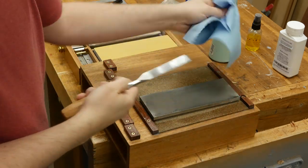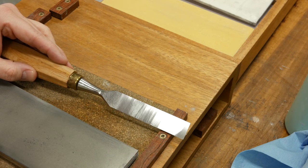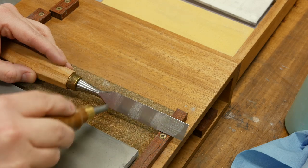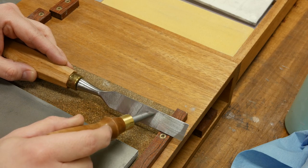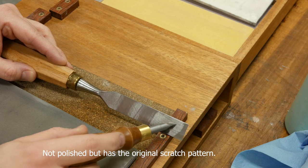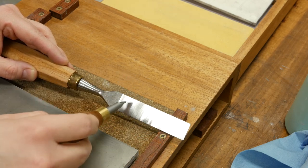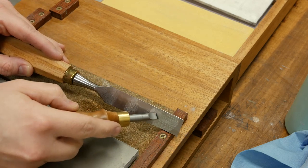Do about 10 passes, then slide the chisel up closer to the edge — not on the edge, but probably about a quarter of an inch away — and do a few more passes, just keep working it back and forth. Now stopping to take a look: you're going to see two different scratch patterns. The ones from the factory go one way, the ones I put on go the other way. As you can see, it flattened it here and up at the tip, but right here it's still polished — so it's not exactly flat. I'll have to keep working it until I see consistent scratch pattern at least three quarters of an inch in from the tip.